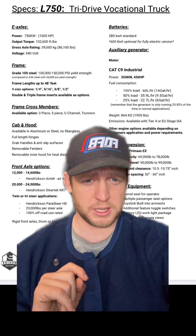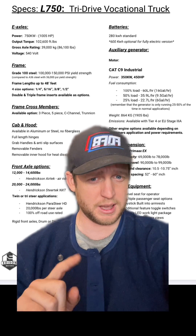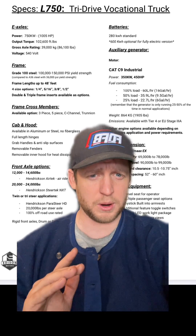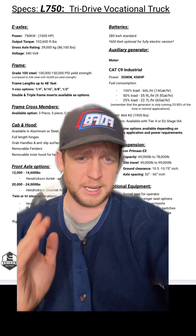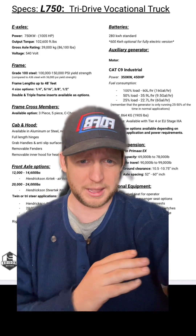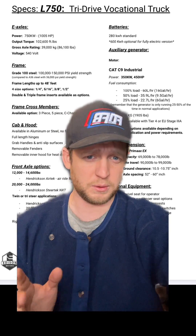But remember, it recharges the batteries in about 40 minutes, so you're really only running it half the time — meaning you're burning about 30 liters per hour with this C9. You get about two hours of drive time off the batteries, so if you run the generator for half an hour to recharge and then drive for two hours, it works out to about 15 liters per hour run time.